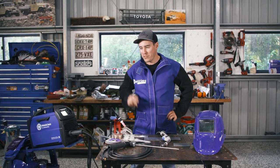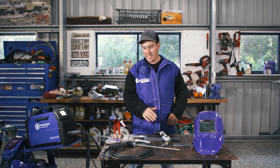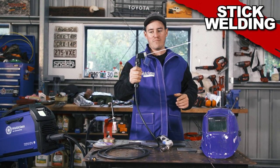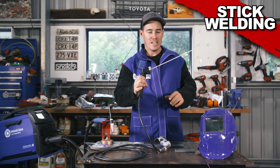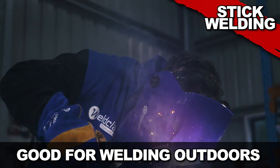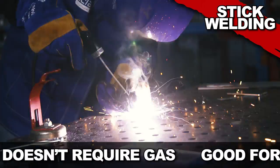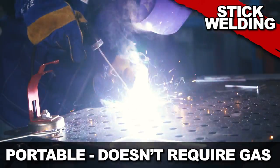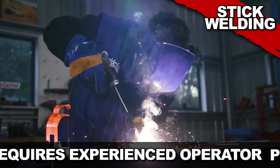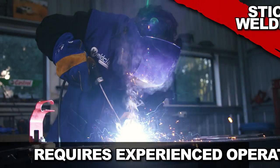There are several different types of welding, but the three most common — stick, MIG, and TIG — this machine can do them all. First up we've got the old stick welder. You probably saw your old man weld with this; it's the first thing I actually welded with back in the day. Stick welding is good for welding outdoors or in wind as you don't need gas. It's also very portable and easy to take to a job, but it can be hard to strike an arc and the quality of the weld depends heavily on the experience of the operator.